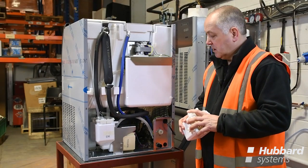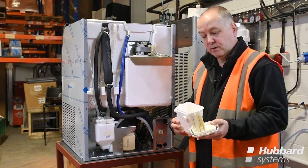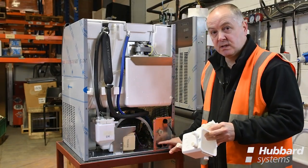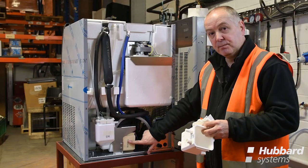Before changing any parts on the unit, it would be wise to check the inside of the pump tank system by removing the lid and cleaning the necessary pins, and also ensuring that the drain off points to drain are not blocked with slime or bacteria. You may also need to check the integrity of the electrical component of the pump or the control.